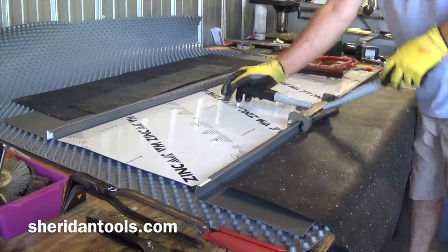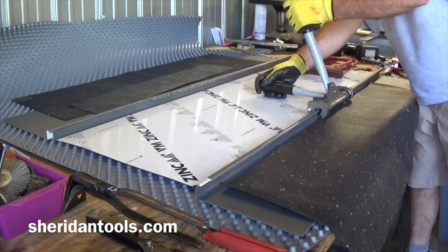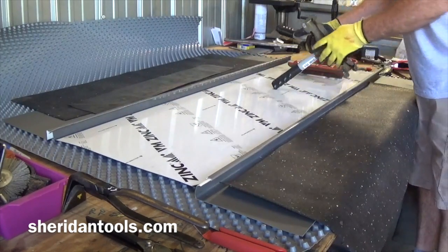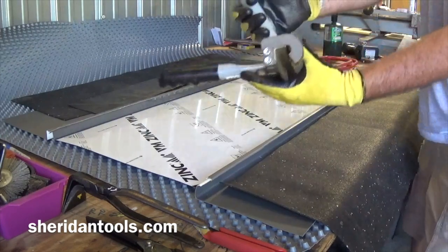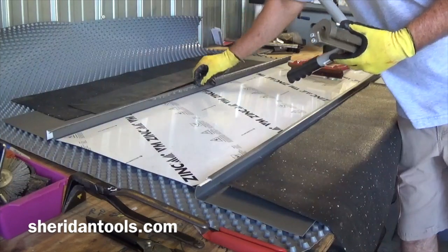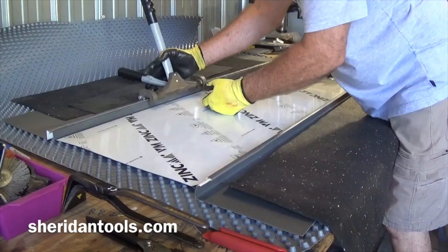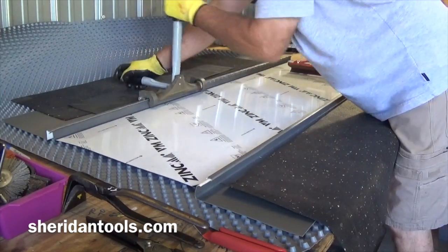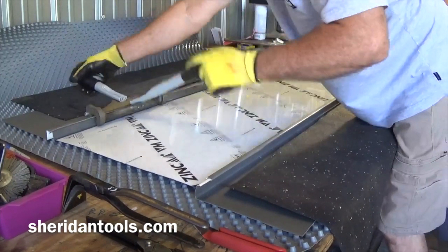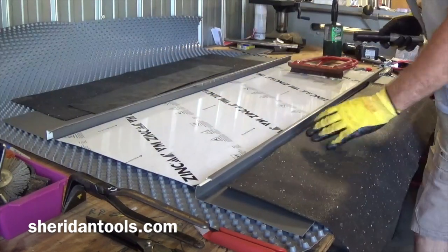I like this tool particularly for repairs. This set of tools, the ESE lockers, for a couple of reasons. They lock on more of a radius. So when you have a seam that's been taken apart like this, you want to try and have it be formed back together as clean as possible. So if you put this on there, get that set right, you can see that eliminates most of those marks that we had on there from the third stage tool.